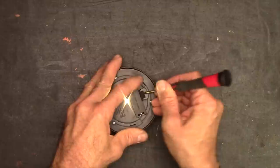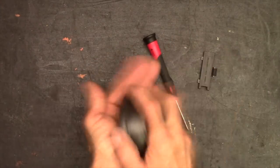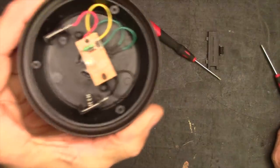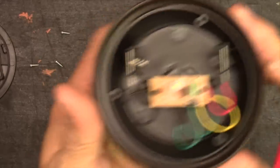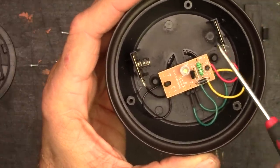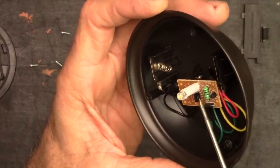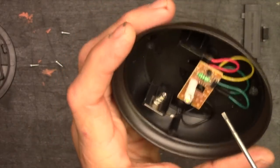Let's pull the battery out first so I don't have that light blasting me in the eyeballs. Three screws. Whoa, look at the size of that circuit board — freaking huge. Not much to it, huh? There's an LED, a diode, a resistor, and from what I can tell, that's a voltage detector — it's a four-pin unit. I looked up the data sheet number but it doesn't quite make sense for that package. There's a number that matches something that looks like a surface-mount five-pin voltage detector. So that might be what that is, or possibly a voltage regulator.